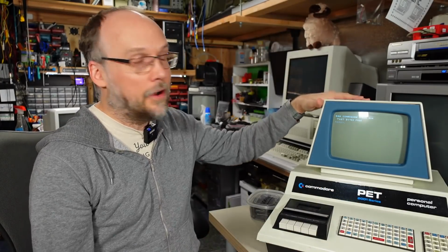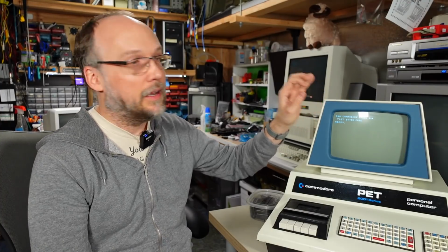Now, I brought up the fact that Chuck's monitor wasn't fixed by at least some of these mods because I wanted to illustrate that when you're working with CRTs, it's an analog domain, and unlike the digital stuff in a computer, where it's a lot more cut and dry, you have high and low TTL logic, 5 volts, at least on a computer like this, on the CRT we're talking micro or milliamps or picoamps or whatever. That kind of leakage, while normally not affecting the overall operation of the monitor, clearly has an effect on it. And things like a diode that still sort of works, but clearly wasn't working quite right, those problems are really hard to track down.